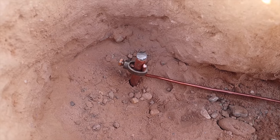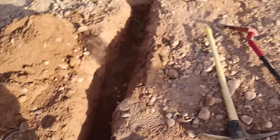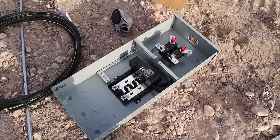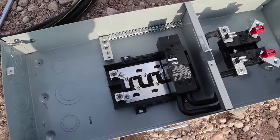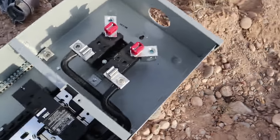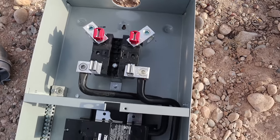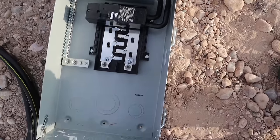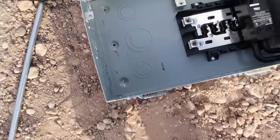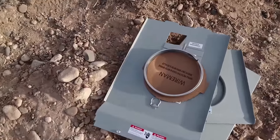That's the two 5/8-inch diameter copper ground rods — I basically drove them in about nine feet using a twenty-pound sledge, and it worked out really nicely standing off the back of the tailgate. There's your hanger — that hole at the top is how I'm going to fasten it to the pole, and then I'll also use the hole at the bottom, so I have two mounts to the actual wood pole.